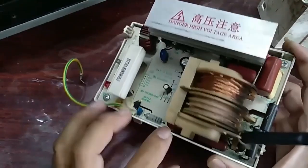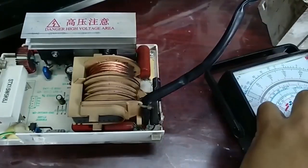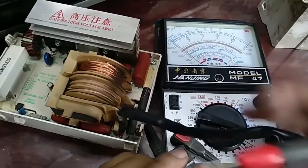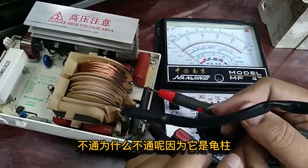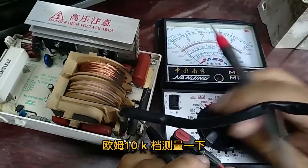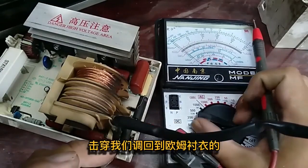After the resistor there are capacitors and two diodes. Let's check these diodes. We'll use the one-times ohm scale on the multimeter. It looks open — but that's because these diodes for microwaves have lots of diodes integrated inside, not a single one. So let's use the 10k ohm scale to test it.